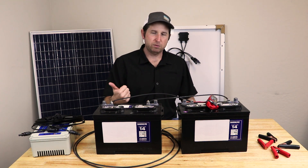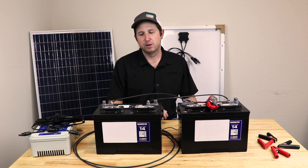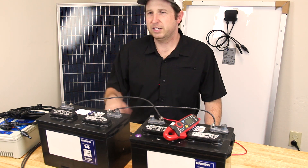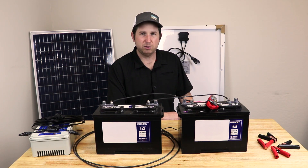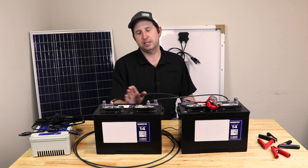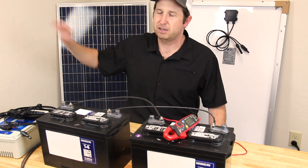There are four main voltages for battery banks today: 12 volts, 24 volts, 36, and 48 volts, with some higher voltage systems emerging. For general off-the-shelf charge controllers, 24-volt and 48-volt systems are a good choice. For higher power systems past a kilowatt, you really want to move up to 48 volts to minimize the amount of current being pulled through the batteries into your downstream units.